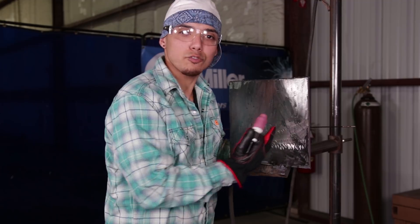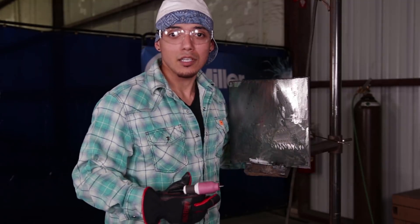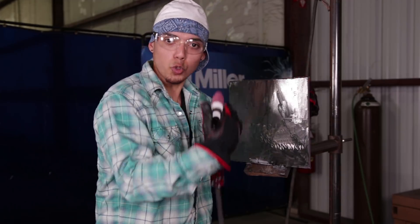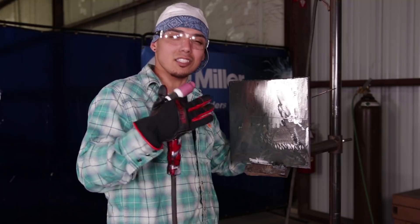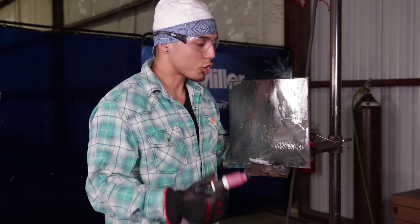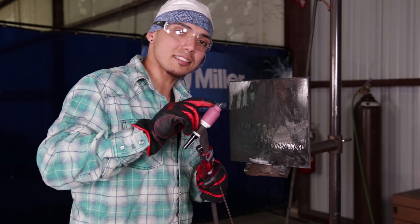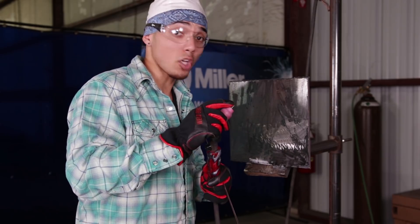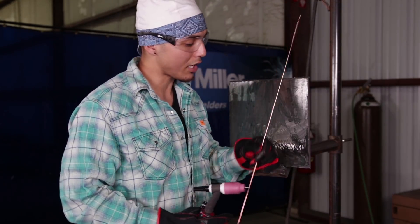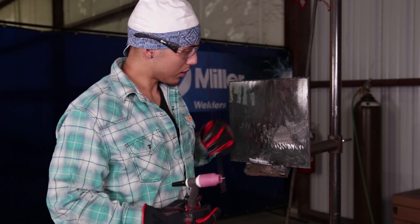Horizontal on TIG — a lot of people have trouble with this, especially if you're welding pipe or plate. They tend to be inconsistent on their welds. It gets too wide or it's drooping, or the rod's not favoring one spot. I'm using a flex head TIG torch, 17FV, 2% lanthanated tungsten, nice and sharp. I'm using ER-70S2 1/8th filler wire from Blue Demon.